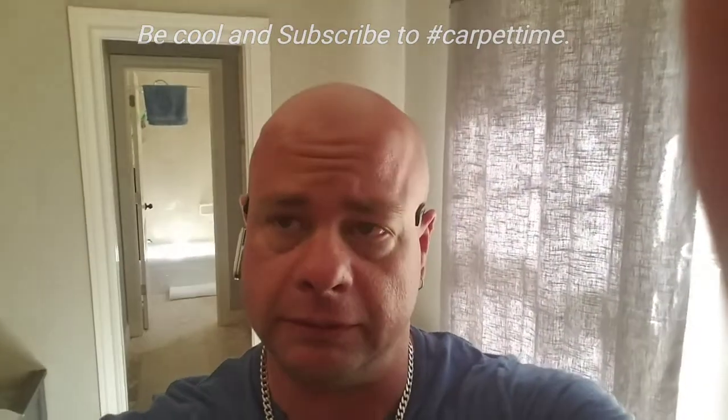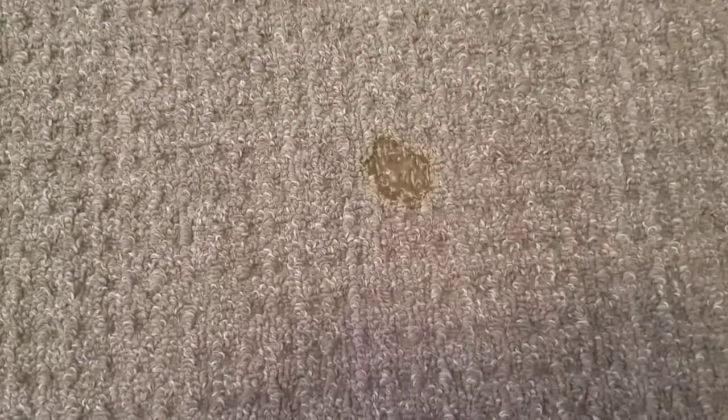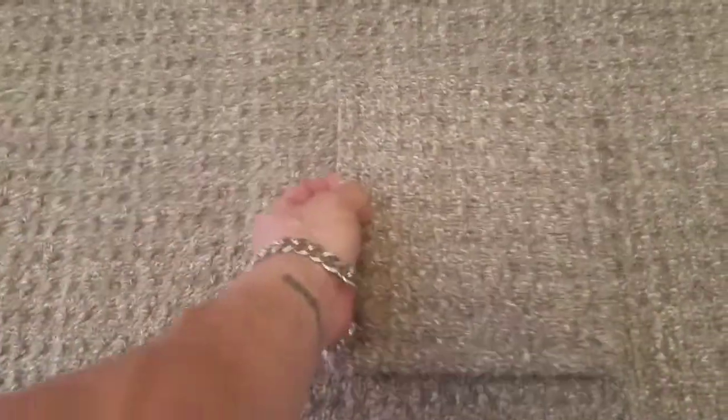What we're looking at here is a burn in a carpet. A burn this size in a typical carpet is just not a problem at all. The problem here is that it's a patterned Berber, and with Berber the carpet is traveling in a certain direction. These two cuts here I cut to fit in — those two cuts are fine.